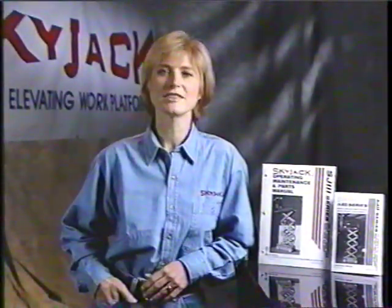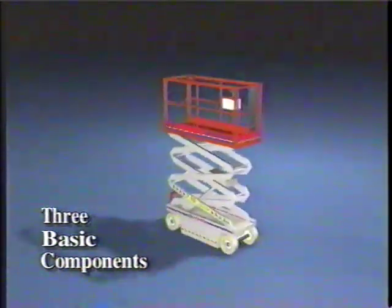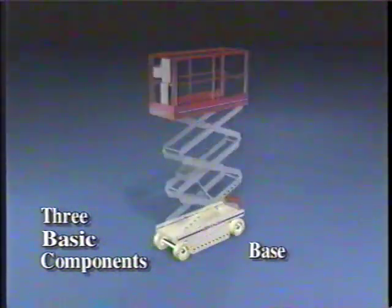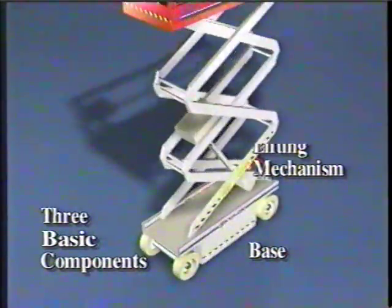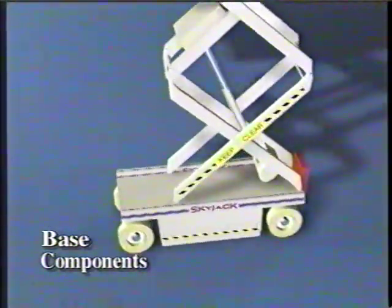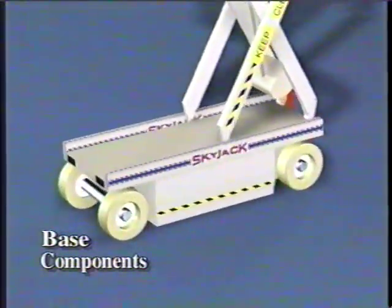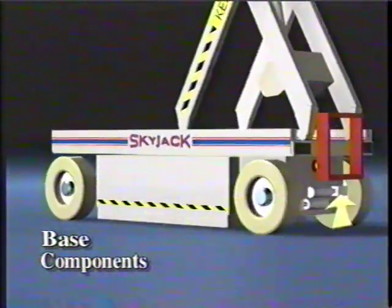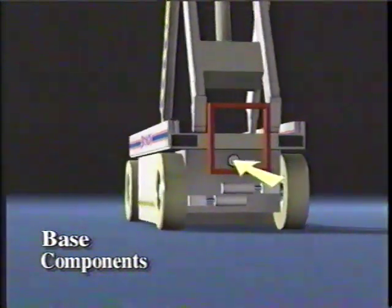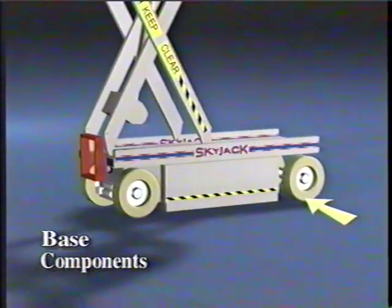Now it's time to discuss the specific features of your platform. There are three major components to a SkyJack SJ3 series work platform: the base of the unit, the lifting mechanism, and the platform. Let's first talk about the components located at the base of your machine. As we move around the base, we see the integrated forklift pockets, the electric hydraulic tray, parking brake, emergency battery disconnect switch, freewheeling valve, battery tray, the pothole protection device, and finally, the steering and drive wheels.